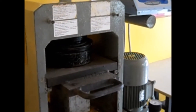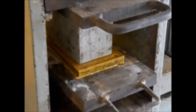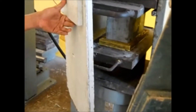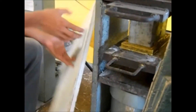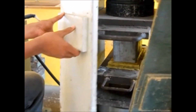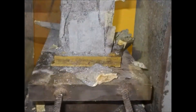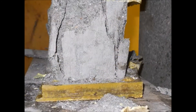A bit-by-bit load will be imposed until it meets its compressive strength limit. Covering the sample during testing is necessary to prevent the spread of its parts when it cracks, bursts, or is stressed. The premonition that the brick is nearly at its limit is when it shows cracks, shearing sounds, and the like. This is the moment testers should start recording and carefully impose load, to prevent overlooking the sample's capacity and cease the process at the awaited point of failure.